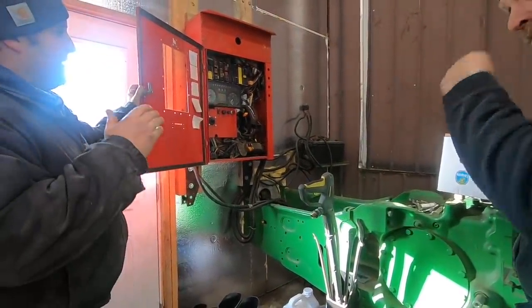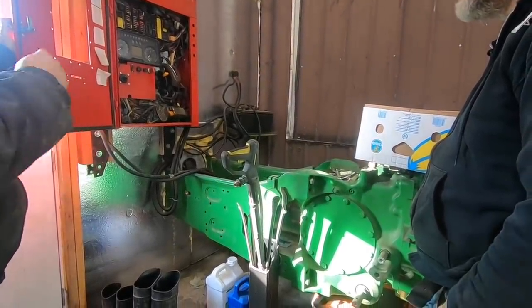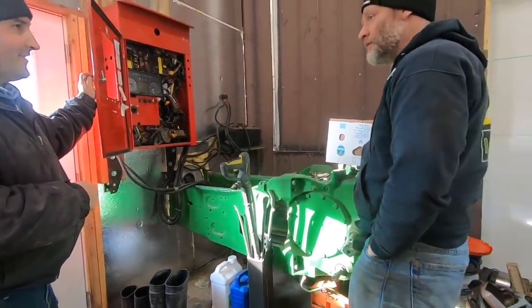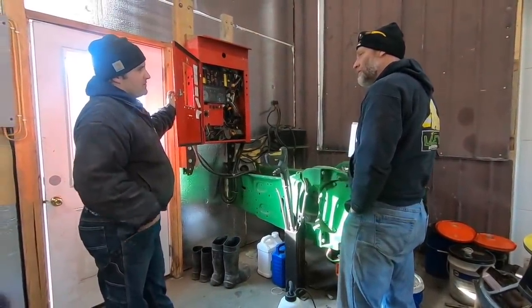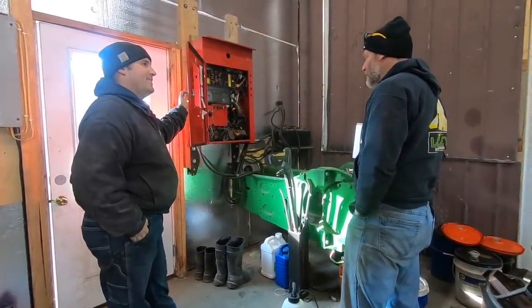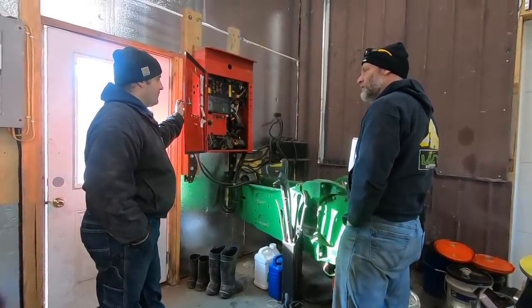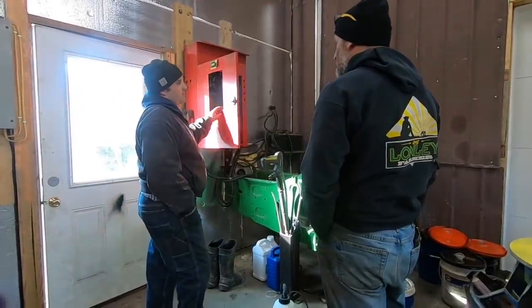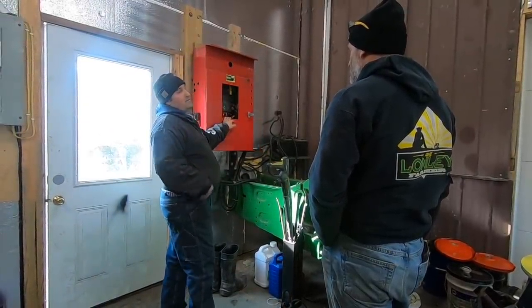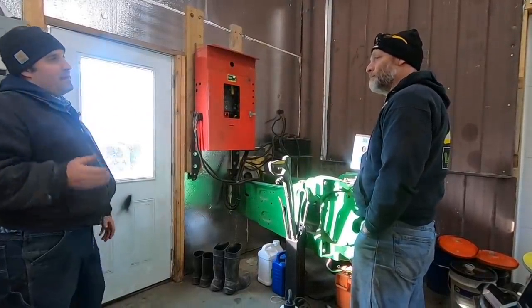Send them out, we want to be able to at least calibrate them. Right. And if they calibrate in a 20 series, they're going to calibrate in an R series. A 20 series is one of the most finicky ones to calibrate. Yeah, that's what Richard was saying. We had some that never calibrated and they're still going strong, but the forward reverse modulation is where I like to do the calibration. Did you ever do a calibration on yours?